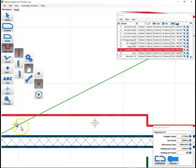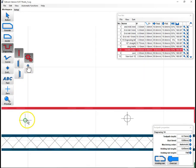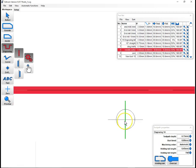Usually there's a circle on these that I can get it to pick. Oh, there we go. We'll go back to automatic. And that'll give us that full circle. Hopefully they're the right size. I'd rather just make a mark in the center, but that's a little bit more complex. Sometimes, like for CG marks, I'll just do a 0.75 cut along the line. And one option you could do is you could just do a 0.75 cut along this line and this line. And then when it's done, you just poke a needle through the center to mark your center.